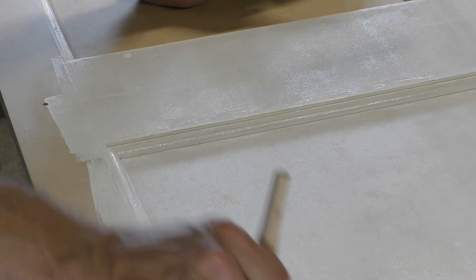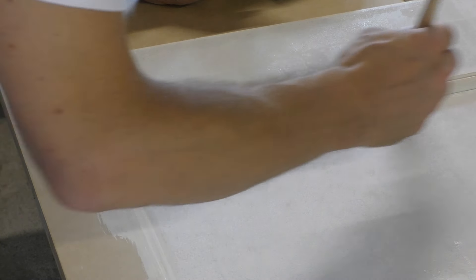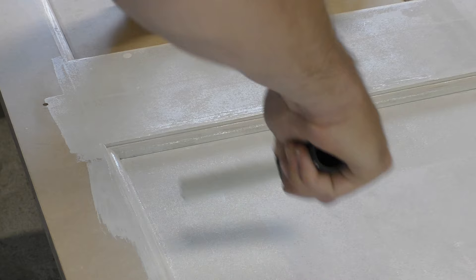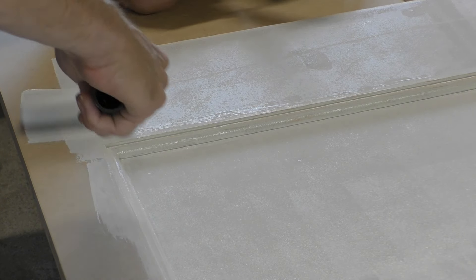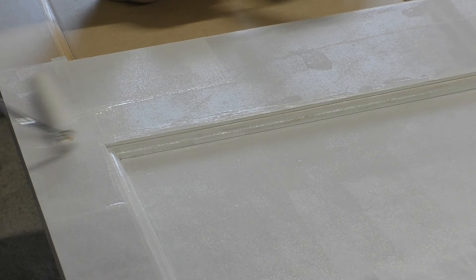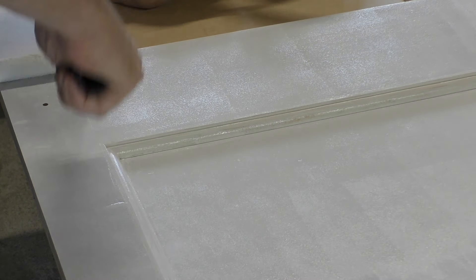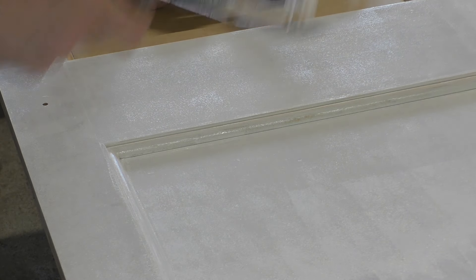Notice I'm using a paintbrush for the mouldings and a roller for the longer sections. Most professional painters I meet on site scoff at using rollers — they think that to get a truly professional finish you've always got to use a paintbrush. But on doors like this it's a lot quicker to use a roller, and I actually prefer the finish you get with a simulated mohair roller.